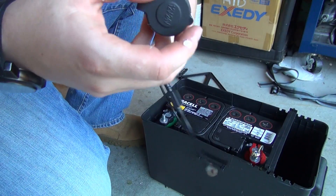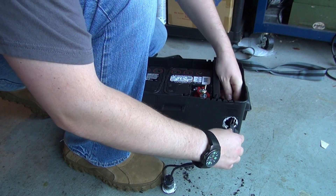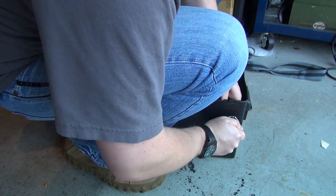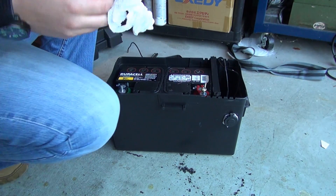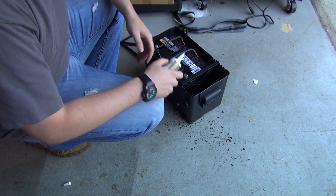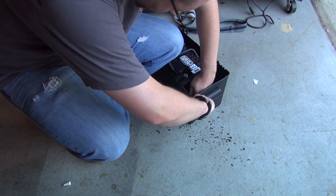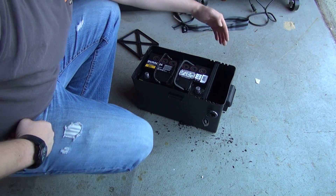We're going to slip our system through and feed it through, then pop that into your hole. I'm actually going to apply some more caulk in a second here. Next thing I'm going to do is apply a little sealant around so that hole is nice and watertight. I'm just going to apply it, pull out this plug a little bit, and begin to apply it as even a bead as I can. This way when I seal it, it's sealed. Now that we've applied our caulk and applied the rear castle nut, we're ready for the next step.